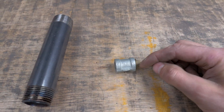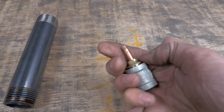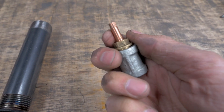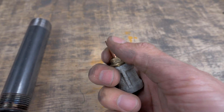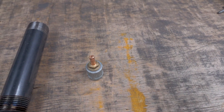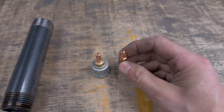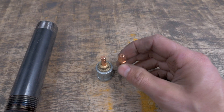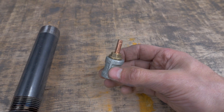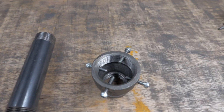Again, very much in Blue Peter style, we have done one. I've put some gas-proof tape on the inside of here and also around the inside of the mig tip, as you can see there. Now these are 0.9 mig tips. I've got two different sizes — that's a 0.9, and I believe the other ones are 1.0, so they're a lot bigger. We can try different flares and different gases out of these to see what the difference is — only 0.1 of a millimetre difference.